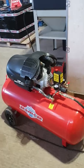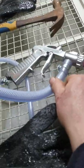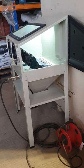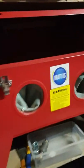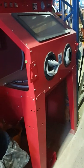Now, people ask me — on this 220 — what about if I get a smaller cabinet? You see that gun in there? It makes no difference. That's just a vessel. The actual size of the cabinet is just a containment area. So it makes no difference if you go for the little 90, the 190 bench one, another 220, or the 350 — they're just bigger containment areas. They all have the same gun, so your compressor requirement would be the same.